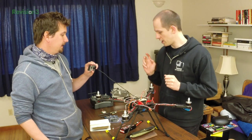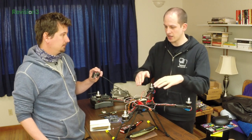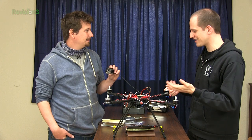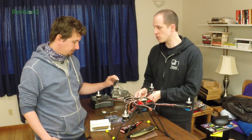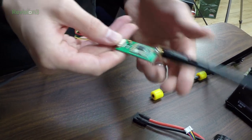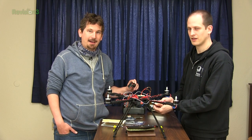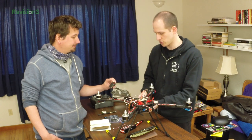The next thing we want to do is get the telemetry out of it. Before, we were connecting directly to the board over USB to serial — we're not going to use a really long USB extension cable. It is easier if we are not tethered. What you actually want is a serial radio modem — a wireless UART, a wireless serial link. It's just bits through the air, nothing more. There are a plethora of different options you can choose from.